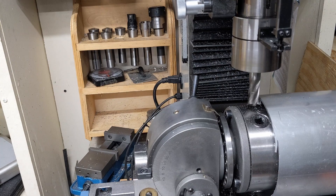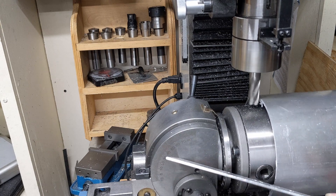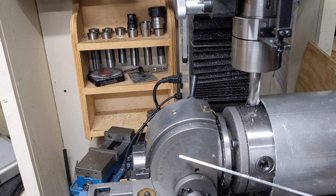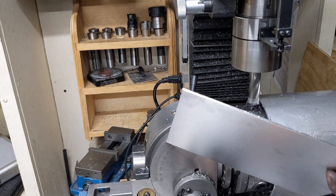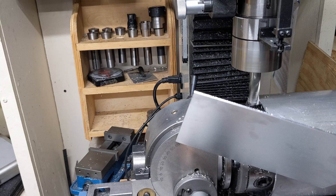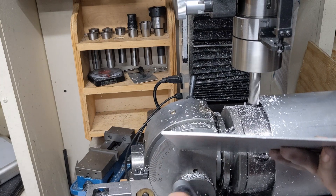The advantage of doing a lathe operation on a milling machine is that you can choose the pace at which you do your cutting. Because the tube itself is not spinning at high speed, there's not as much chatter and you can generally support it without anything like a steady rest or similar tool. Crucial to this operation, however, is the fact that we have access to the area behind the jaws to make this cut.